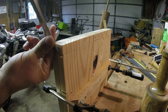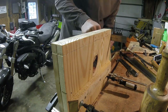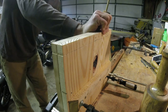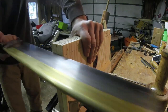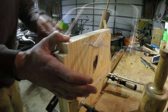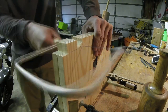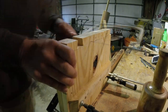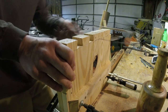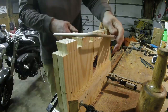For those new to dovetails, it's really not a good idea to start on a soft wood like pine. These are actually my second hand-cut dovetails ever — the first ones were a disaster because I was cutting along the grain. Always cut on end grain like I'm doing here. Pine compresses under the chisel rather than shearing and slicing cleanly, so it's very challenging to do delicate fine joinery. This was designed to be rustic, so a rustic look was inevitable.